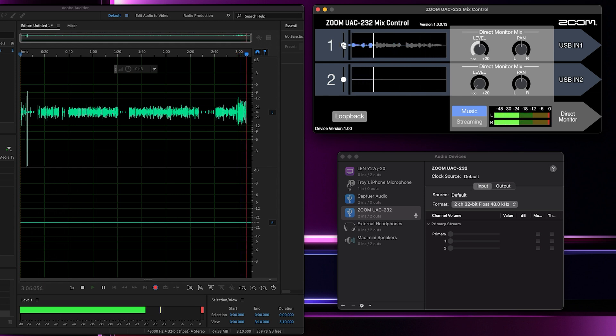You can adjust that to suit — it basically increases the waveform. That's going to be very useful for when you're recording something out live, maybe a Zoom call, Teams call, live streaming, so you can still bring it up to a level. One thing you need to be aware of with 32-bit float is that all companies will tell you that you can't clip it, but there are still areas where you need to worry. Number one is a microphone's max SPL — if you go past a microphone's max SPL, which is going to be very hard with speech, that is going to be clipped audio going in. So if you clip before you go into the converters, it's still going to be clipped.